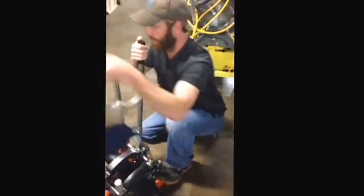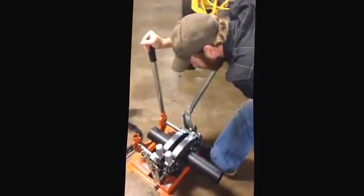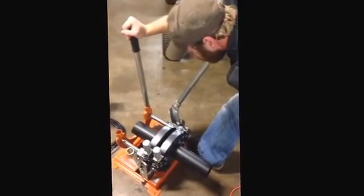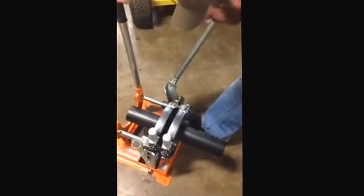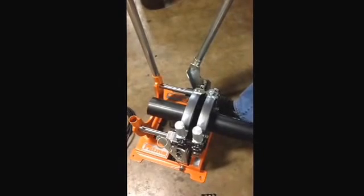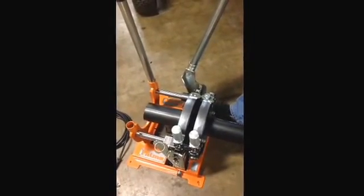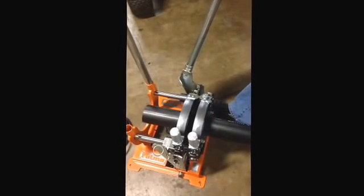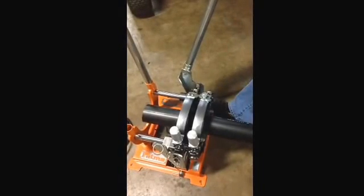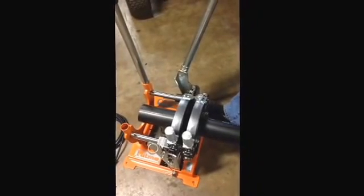I'm going to open the jaw, remove the heating plate, set it in the stand, and then close this and apply the pressure. I've applied the pressure up to the point where that cam for the stop is touching so that I know my bead width is going to be the right amount. I'm going to hold pressure on here for a minute or so, and then keep some fairly decent pressure on it while I'm waiting for the pipe to start cooling down.